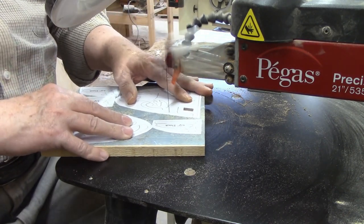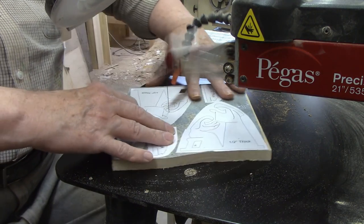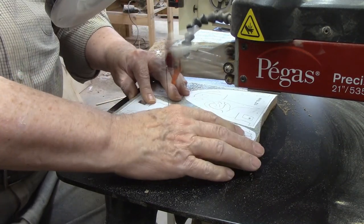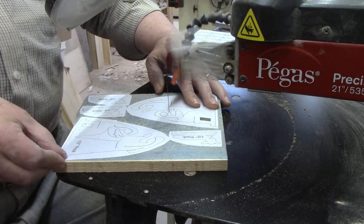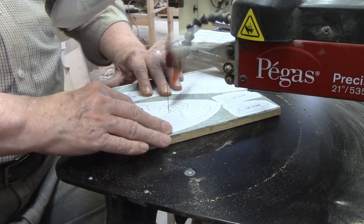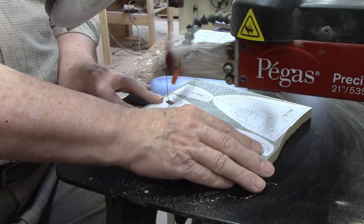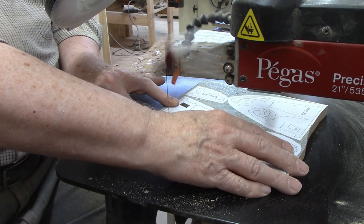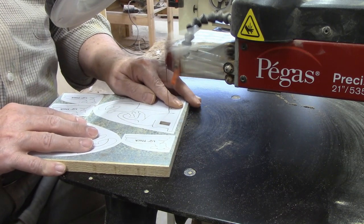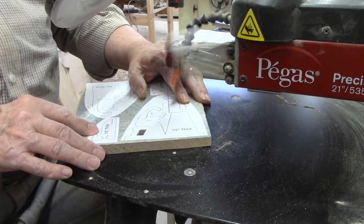The piece with the figures of Mary, the baby Jesus, and Joseph has several accent cuts that add detail to the piece, making it more realistic looking. There are three ways to approach making these cuts: the first is to cut around the outside of the piece, then come back and cut the accents; the second is to make each accent cut as you come to it; and the third is to combine the two — making some accent cuts as you go, then coming back for the rest. The approach depends on the pattern, and for this one I chose the third option. Where it's easy to cut freely and make accents as you go, do so; but if the accent is at such an angle that it interrupts the flow, continue and come back to it later.